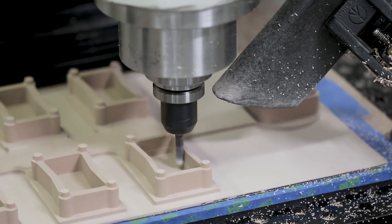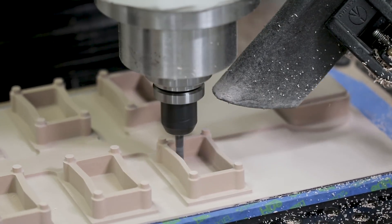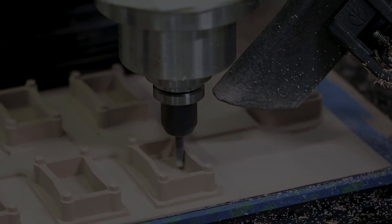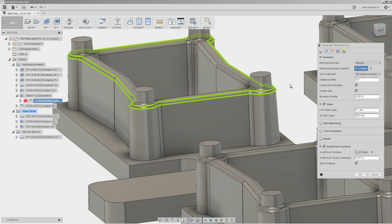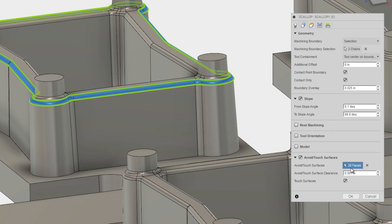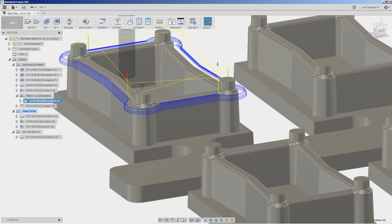I was really happy with how this turned out — we had almost no chipping and we've got an absolutely superb surface finish. It's an awesome example of making a beautiful part with the Tormach. After we finish that contour, we're going to switch over to do a scallop, which is really one of the best 3D toolpaths. We've got two chains selected — the outside and inside edge of that fillet — with touch surfaces selected for each one, contact point boundary, and the slope angle defined. Those are the major settings that help us get a clean toolpath to machine that fillet.